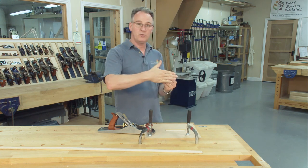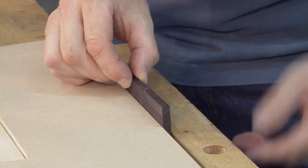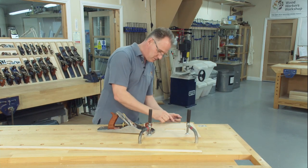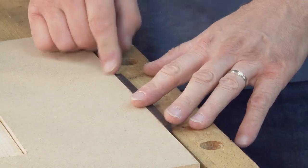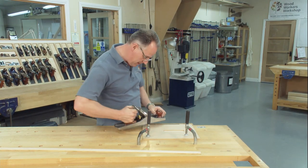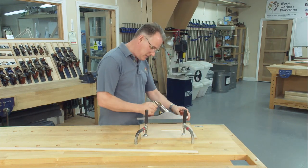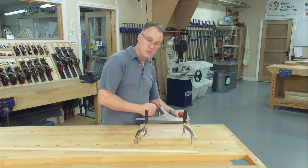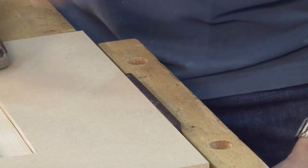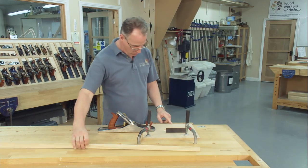The edge can be quite difficult to try and balance a plane on, so to get over that I would put them in the vise. I've got a small batten strapped inside the vise that forms a little shelf for my timber to sit in. I can then get my flat plane referencing off the MDF and plane the edge much easier than trying to balance on a thin edge — and also the long plane will stay flat on here.